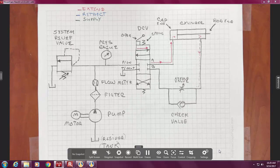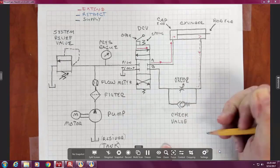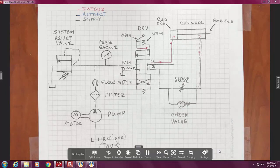In hydraulics and electrical and pneumatics, they often have two sets of symbols, a simplified symbol and a more complex symbol. The simplified says, oh, this is a regulator, goes on your grill. Well, there's different springs in there, and maybe vents and ports, and they don't want to show that. They're just giving you a simple symbol. Doesn't mean it's that simple inside, okay? So a check valve, actually, this is the simplified symbol, and the complex symbol would show there's a spring pushing the ball to the left. That's how it knows to only let oil go one way. You can draw that in if you like, and you'll see them drawn both ways.